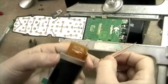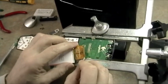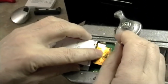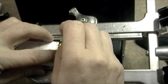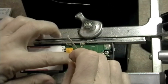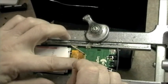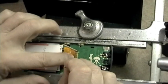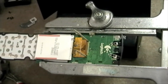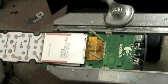I'm going to use two toothpicks to align the holes on the module with the holes on the board — that's exactly what they're there for. This will align your leads perfectly to the pads on the board. Then press down gently so that the tape adheres to the board. I've got my iron set to 600 degrees Fahrenheit and I'm using a 1/16th bit.